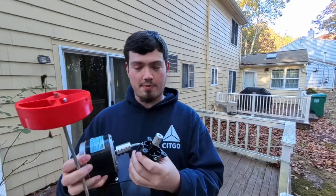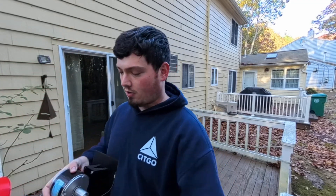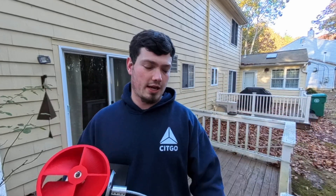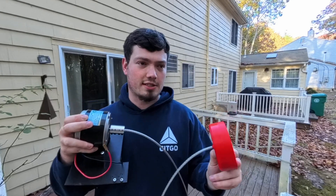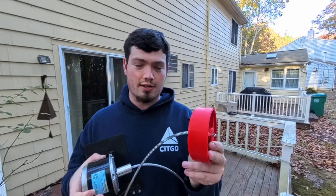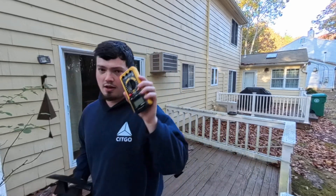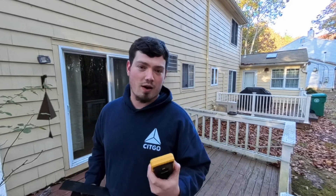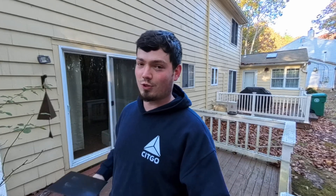This large motor needs 2500 RPM — it requires a lot less torque but a lot more speed. The small motor requires a lot more torque but less speed because of the gearbox. We're going to go over and test both of these since they both have an 8-millimeter shaft. Whatever one makes more power, we'll also use in the next video and increase the pitch. I think we're still going to need to add a gearbox to this design. We also have the multimeter and I have new test leads.